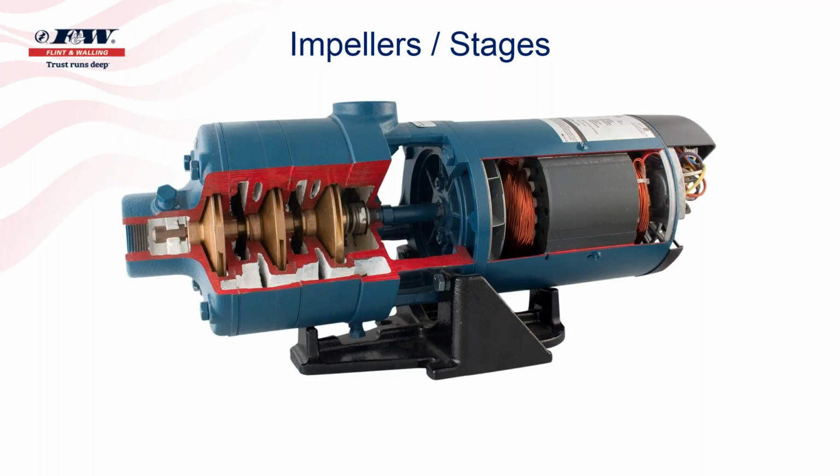Well, I saw the guy a year later, same show. He came up to me and said, "You remember?" "Yes, I remember you from a year ago." And he said, "Well, I went out and changed all those pumps. I put your pumps in around that lake with the brass impellers." And I said, "And?" He said, "I have not had to go out and change one set yet." So I suppose there's an argument in certain applications for a brass impeller over a plastic impeller. So that's a centrifugal pump, the way it's designed.